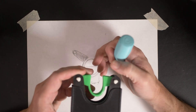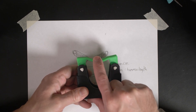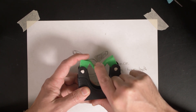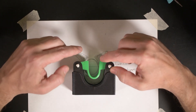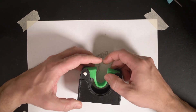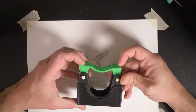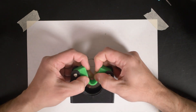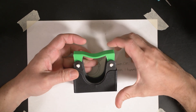The handle releases itself instead of continuing to need pulling. Right about at this position the gripper wants to pop itself open naturally — I just give it a little nudge. But from the point where the faces are parallel to each other to that pop-open release point, I'm actually having to apply more pressure, because the hammock is being squeezed together as the motion goes until that release point — that's when the hammock starts to spread open again. Until that point the hammock is being pinched together, effectively acting like a big leaf spring. In order for this to work, we need the friction of the handle being pulled out to pull the gripper to roughly 45 degrees where the leaf spring can release itself and reset the gripper.